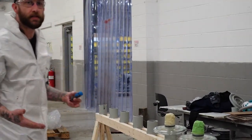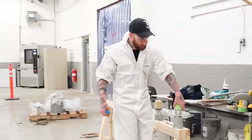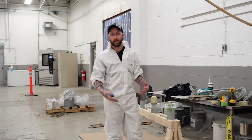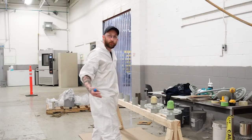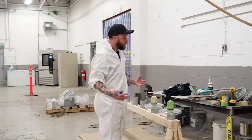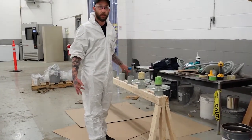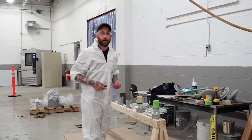Now we're ready to start coating the insulators. We recommend you set up saw horses with some PVC pipe to support the insulators — that's going to allow for easy and quick changeover from doing one side and easy to flip to do the other side. If you need to do hundreds or thousands of these insulators, multiple saw horses can be set up at once in a large room such as a factory or a Quonset hut. This allows for easy movement between the insulators, and you can set them up to each accommodate one string or have hundreds set up so you can walk back and forth without waiting to put on a second coat.